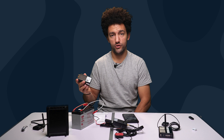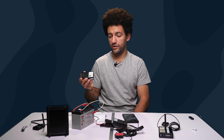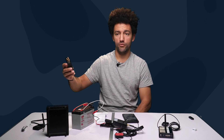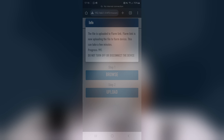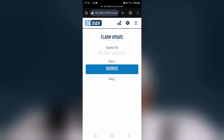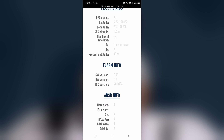The FlarmLink's Wi-Fi and Bluetooth network provides the same features as the PowerMouse Plus and PowerFLARM Fusion — meaning any configuration change, firmware update, or trace download can now be done wirelessly over Wi-Fi. Your FLARM can be buried behind the panel, out of reach; no USB stick or SD card required. Once the update finishes, the FLARM reboots. Refresh the page, check FLARM status, and you can confirm it's now running firmware version 7.24.